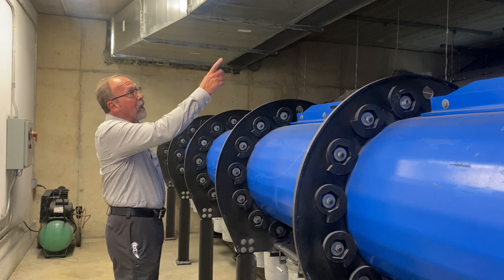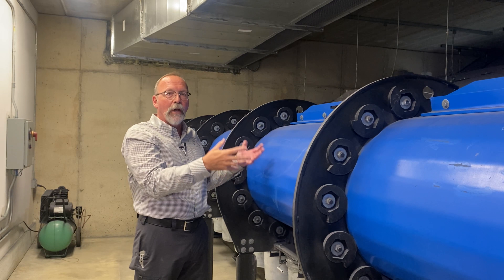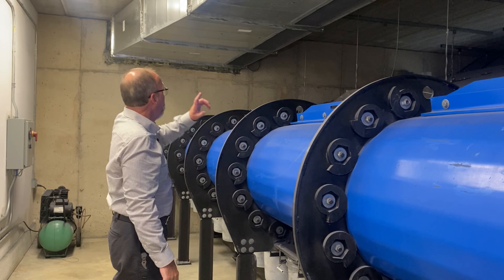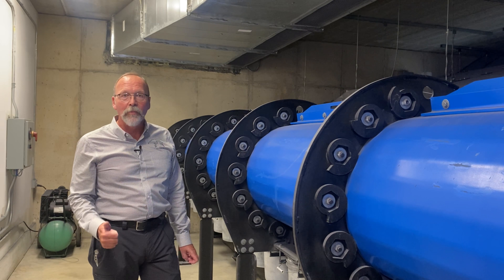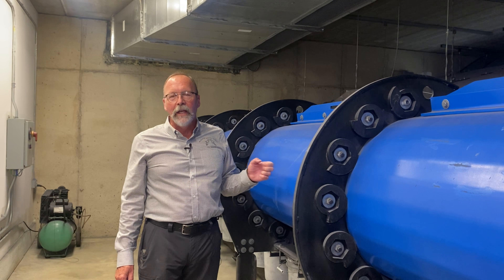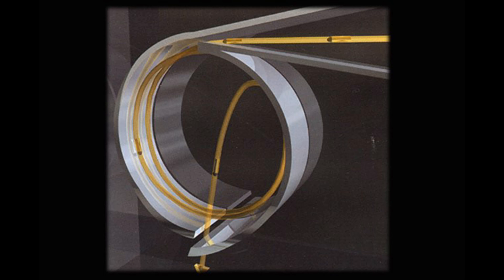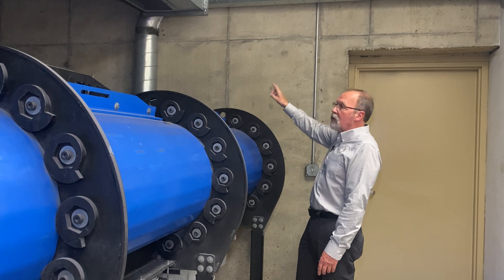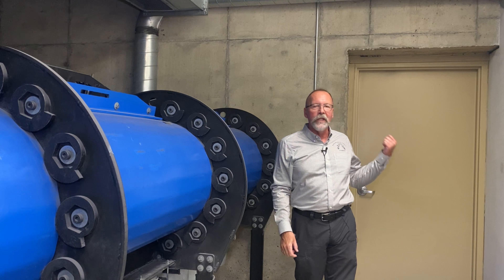Back here we can see the vacuum side of the ventilation system, which draws air out of the range space and sends it out of the building through the filtration system — through the 20 pre-filters and the 20 HEPA filters. The dust generated inside the barrel itself has a separate unit called the dust collector unit. Dust is created as bullets tumble around, so ductwork takes that dust right out of the barrel, filters it, captures it, and seals it up in a machine right outside the building.